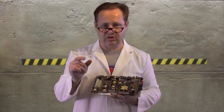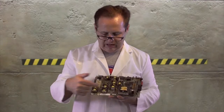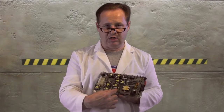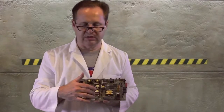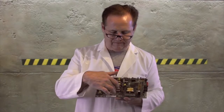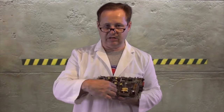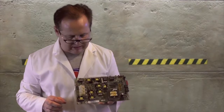The way you would check a fuse is just check continuity across it. Or if you have a voltmeter, check for voltage between the two of them. If there's voltage showing, then the fuse is open — especially in a 220 circuit. In a 110 circuit that may or may not work out. You could theoretically have voltage here and voltage here and the fuse still be open unless you check across it or check continuity. So there is your lesson for today.